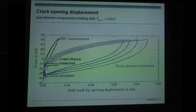Well, if you investigate such deformation fields, you can find such curves force over crack opening displacements. These are the digital measurement results here, and we have seen such type of curves in the model presented by the first presentation. So this is what comes out, and the blue lines is what we calculated in the first attempt using the Chaboche model for our, I should have mentioned that it is mild construction steel, and we try to get that by a node release scheme. And what you can measure as a crack closure load and what you can calculate as a crack closure load considerably deviates, but this is not the real point of my presentation today.